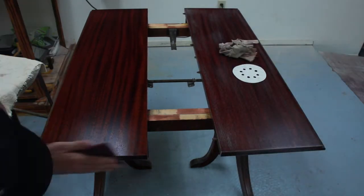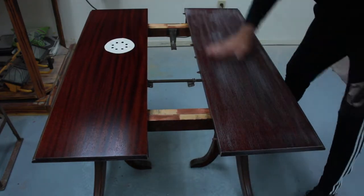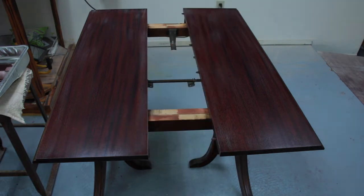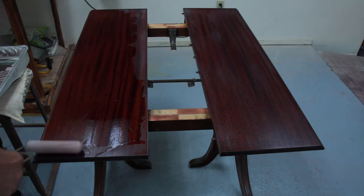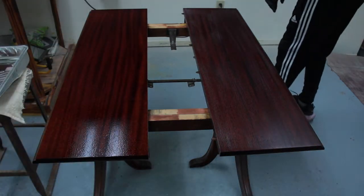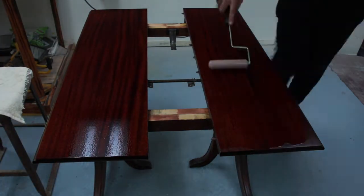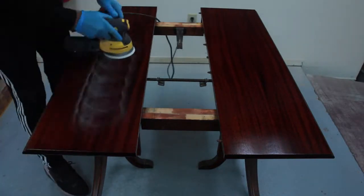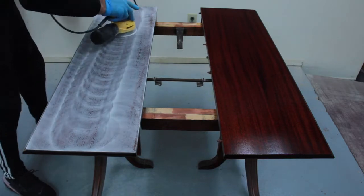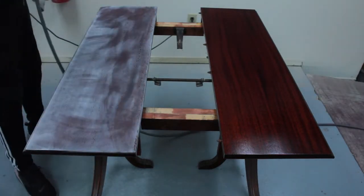Since the sponge incident I took a brand new red Scotch-Brite pad — I wasn't going to take another chance with having to re-strip and re-sand everything again. That seemed to work out pretty well. I also switched to a foam brush for applying the poly. I didn't want to be digging out fuzz, didn't want to take any chances. It took a little bit longer, but stripping off a finish, applying a finish, and then having to strip it off again is a lot of work.